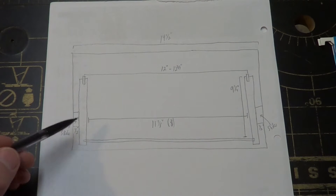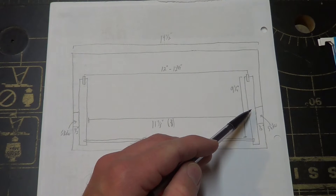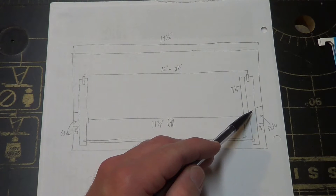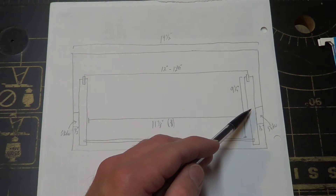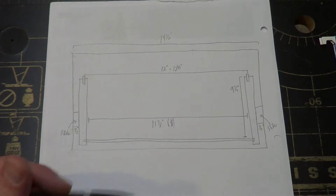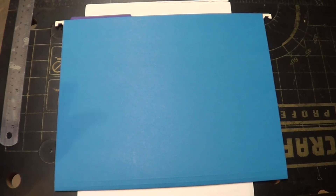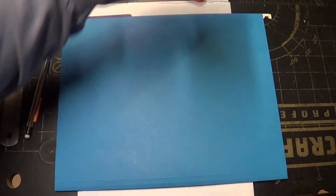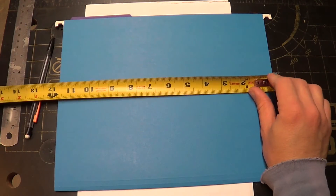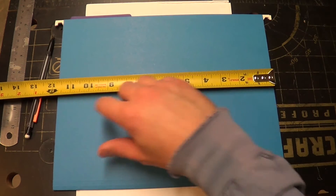Since these are going to be file drawers, I'm going to be using some thicker plywood for these edges — the face and then the sides. I'm going to be using three quarter inch plywood, but one of the things about three quarter inch plywood is it's not actually three quarters of an inch. If you take some calipers to it or just a tape measure, it comes out to be right around .725 inches, so not quite .75 inches. I went ahead and measured one of these files and the width of the file I get is right at eleven and three quarters — just a hair under, but I'm going to call it eleven and three quarters.